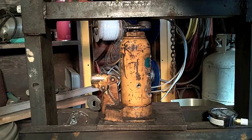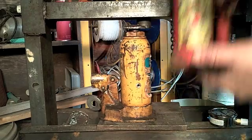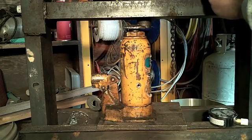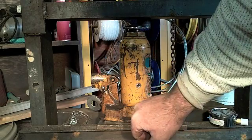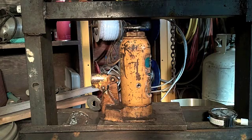Once you've drained the fluid, it's now time to get the jack apart. Unless you have a welded jack — one of the reasons why I'm not using this red one is it's actually a welded jack — it'll come apart in two places, right here and right here. But they both could be really, really hard to get out. Starting with a newer jack, obviously, is going to make this considerably easier.